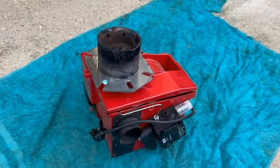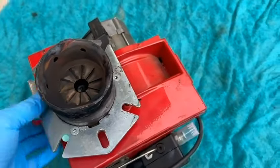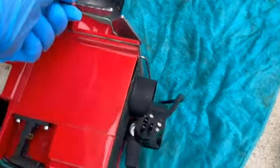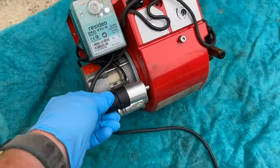So it's a Sterling burner I'm going to be working on. Essentially the blast tube end fell to pieces — the end fell right out of it. On the Beta Sorento it's a slightly shorter blast tube — it's a Sterling 40. You can get a replacement but there's quite a delay on them and I haven't got a second-hand one. So I'm going to take it home, weld it up, and try to repair it temporarily to get them going again, because the house has young children with no immersion heater — they need hot water. Let's get on with the vlog.